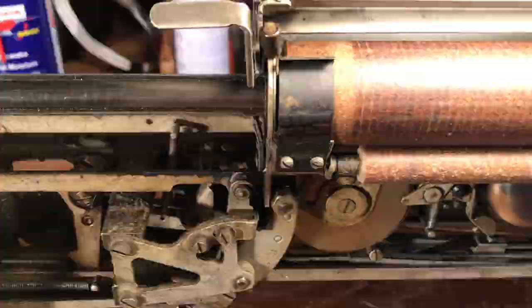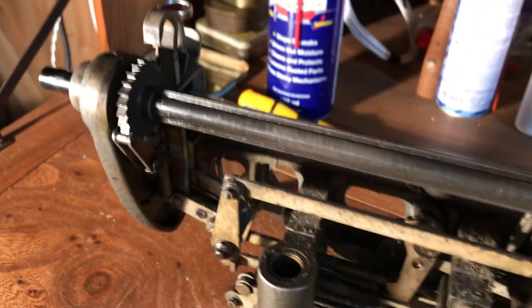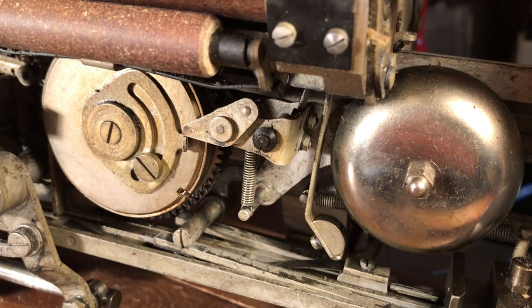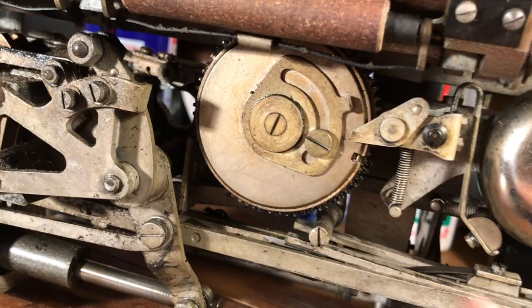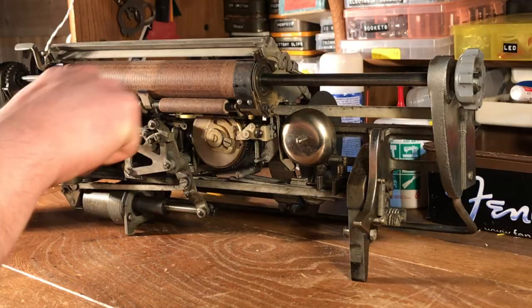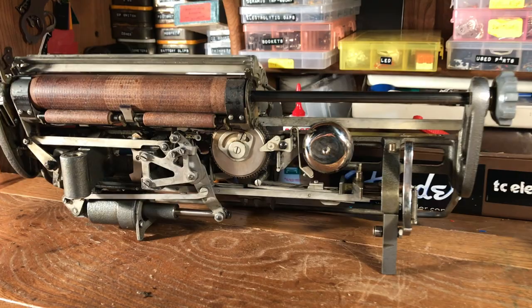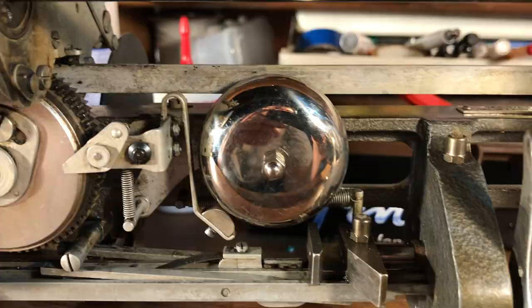A lesson I learned far, far too late in life: if it ain't broke, don't fix it. So many times I've taken stuff apart and broken it when it was perfectly fine. Here's a close-up on how the bell works — there's a little bit attached to the gear and as you push it around, that'll catch on the little arm, lift it up, and then as it goes past, you release the bell striker which is loaded up by that little spring. And that screw there is to adjust it so you're getting the bell at the right point at the edge of the page. For the most part, I think we've achieved our goal of removing years of fluff and guff that's worked its way into the mechanism and got stuck in the old oil, which can block and seize things over time.